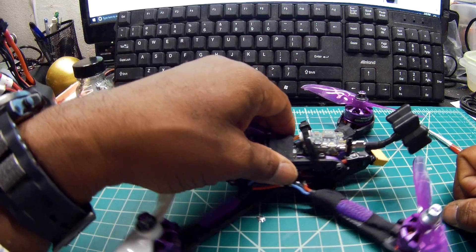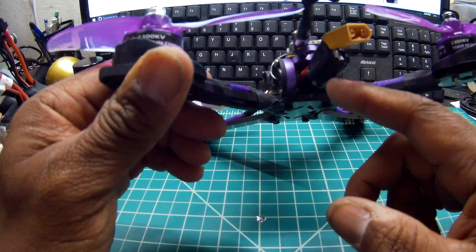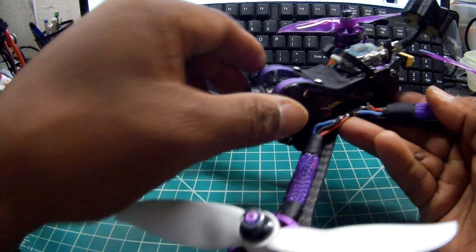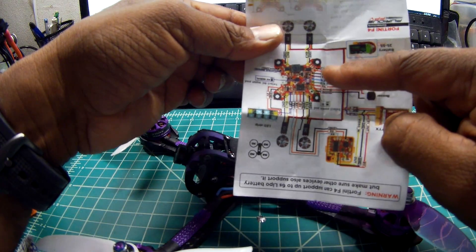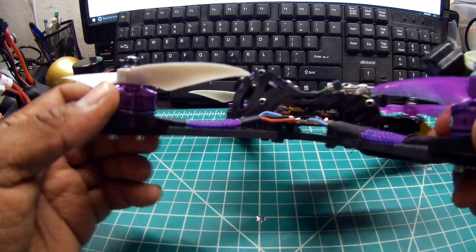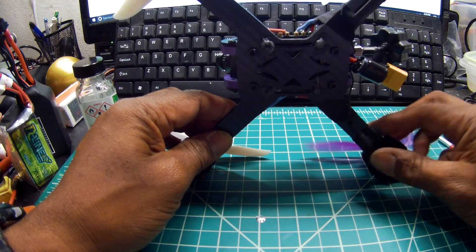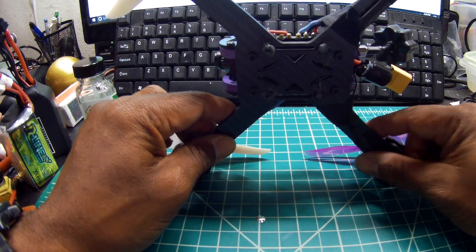Back to this one. I have a 1000 microfarad capacitor on the back — any dirty video is basically gone, it's pretty clear. Also, this flight controller board comes with grommets, so it's already soft-mounted. The whole board is soft-mounted. I've also soft-mounted the motors as well. I was only able to get three bolts in on most of them, but I also used Loctite, so they're pretty stable and locked in.